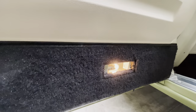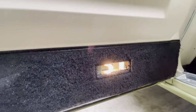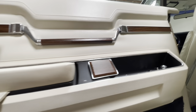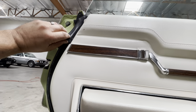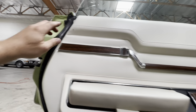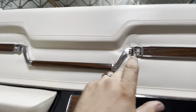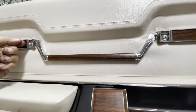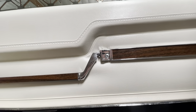I've already pulled the bezel and lens for the courtesy light. Next I'm going to pull these two chrome caps here and here, get these screws out, and undo these screws right here on the edge of the weatherstripping. The screws for the door pull are just underneath those caps — take a small flathead and wiggle it and you can pull the caps off.